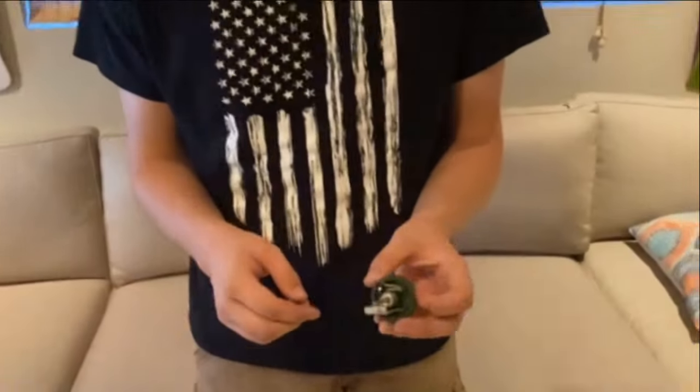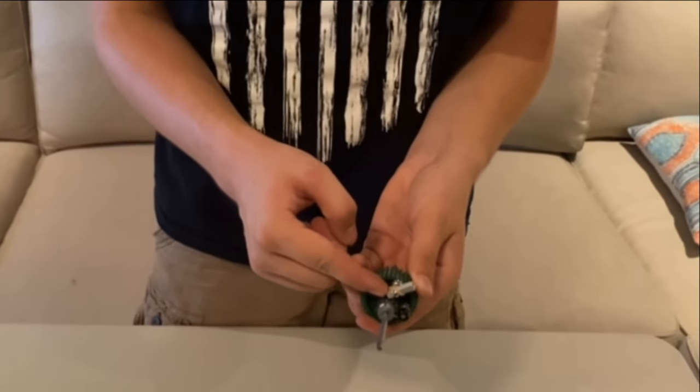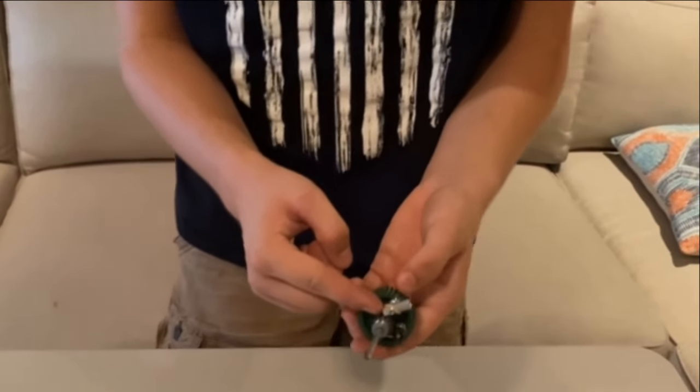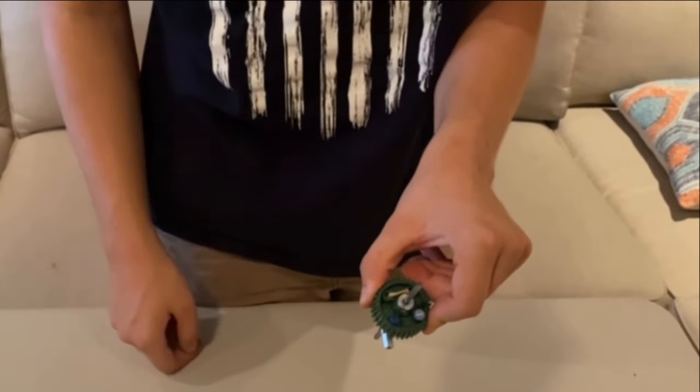If you're unhappy with the friction you're getting, you can move this hole a little bit further away from this edge. We found that gives you a little bit better friction. You can also probably do this with the half inch standoff. And if you're unhappy with this little tail sticking out, you can always grind it down.